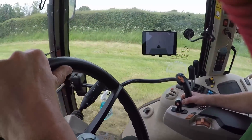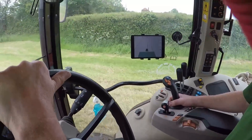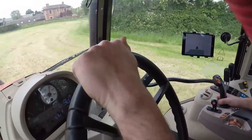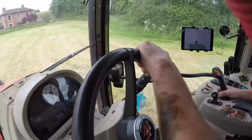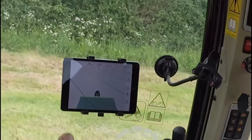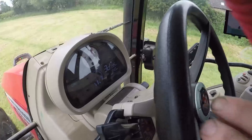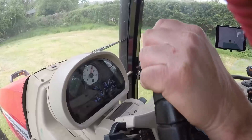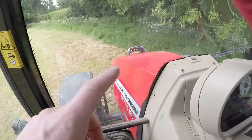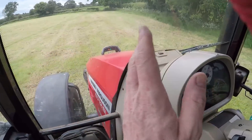We're going around the field for the first time. Everything on the device is controlled via the iPad over on the window. What we're doing is following a pre-recorded boundary line. The lights on the bonnet are guiding us to nine metres away from the boundary, and you can see it is painting a picture of where we have covered as we go along. By having that boundary set - obviously every time you go in a new field you've got to set your boundary - but now we're into this field for the second time, we were able to follow the green light and get our exact nine metres away from the hedge.